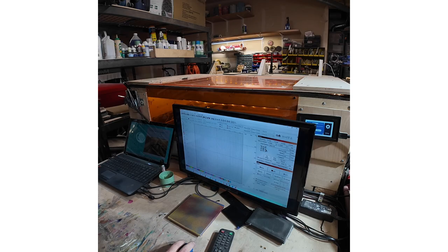So now I'm positioned over the workpiece, and can I move it? Well, the first thing, distance millimeter is 0. Let's set it to 10 and see what happens. Okay, that's working. So the problem is their initialization. The distance in millimeters, which is right here in the move page, was set at 0. That's not a good default. It should be at least 1 so you get some movement. So that's the reason why it probably didn't work in 4 either. So I think we're at this point in good shape. Our most important control is the fire control, which is what I use to actually see where the laser is working, so we're good there.